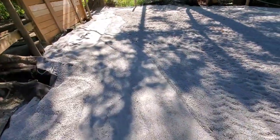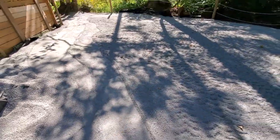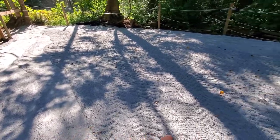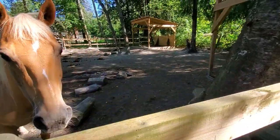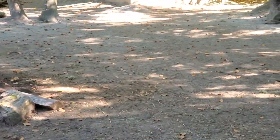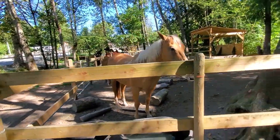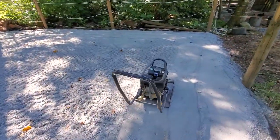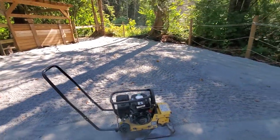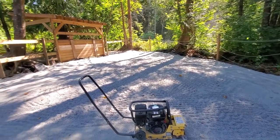It's really important even when it's dry — I'm going to wet it down a little bit. Even when it's dry you can see the difference in height. It won't stay compact because it's dry. I'll wet it, but it's really important to compact this stuff down so that it turns into something harder that can handle all the hoof traffic and not get dug up. We're looking for dry paddocks, and compacting it is an incredibly important step, otherwise it would just sit loose and be gravel.